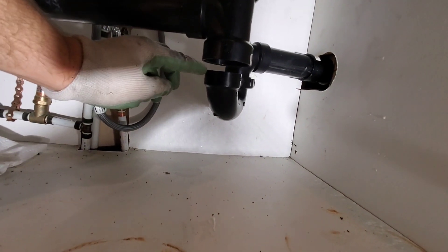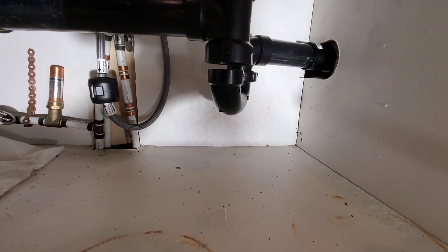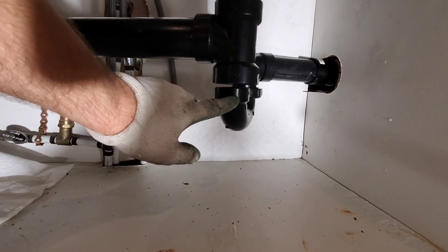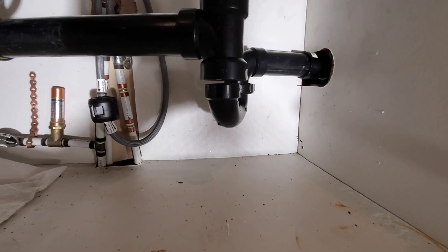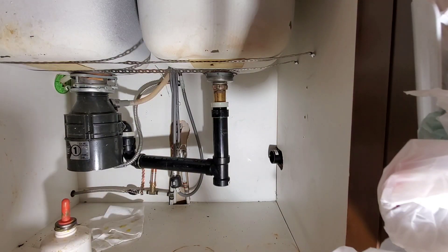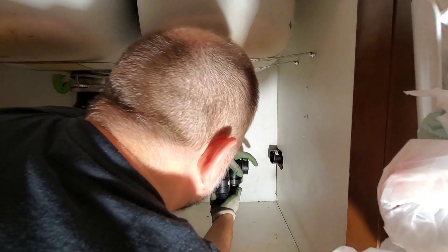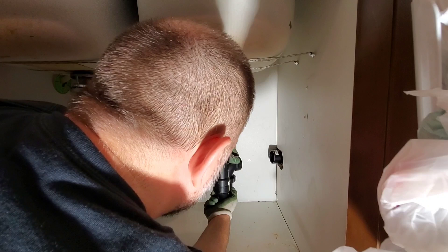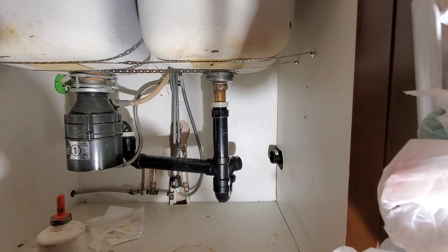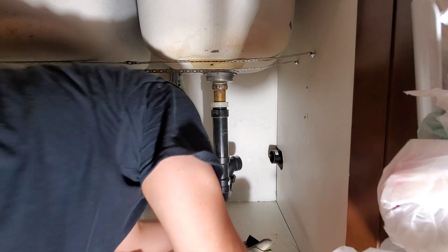So you can see the slight gap between here and here, which means the trap will basically have to be tight to the T, so it'll have some grade. I'm going to glue the piece into here, dry fit it onto here, and then swing it back and forth to figure out where the 45 needs to be. I've glued in my closet piece, so now the trap can move back and forth and you can spin it too — that's why I think this is a better way to go about it. Because the trap arm is so horribly crooked, I'm going to have to eye this out, but with the swing and the trap this gives you a lot of flexibility.